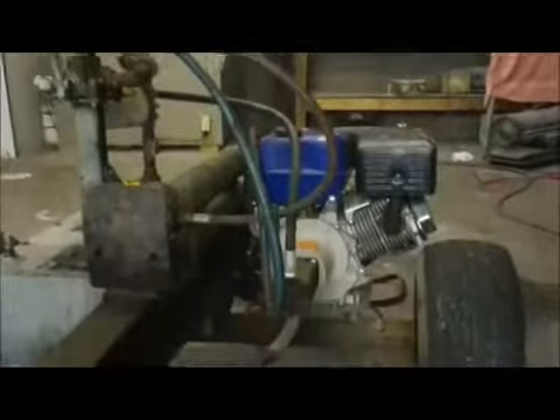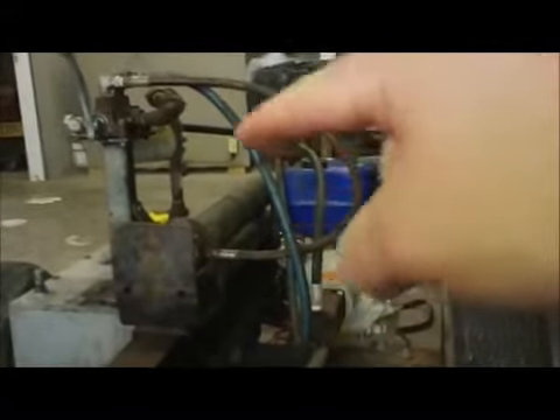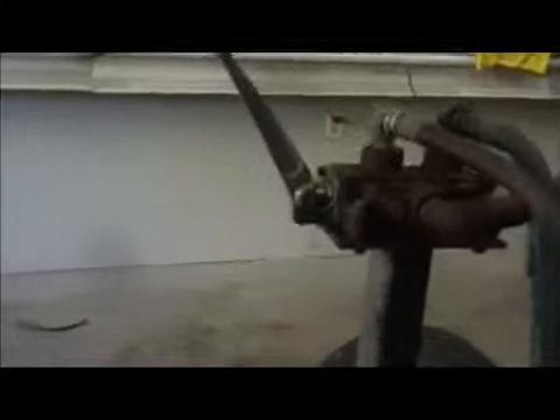This hose right here is just seeping little bits of oil — you can see the droplets right there. So I'm going to go to Napa and have them make me a new hose, and while I'm at it I'm going to have them shorten the hoses, because those hoses don't need to be that long. This one goes all the way out and around, and this one goes all the way up and back to the cylinder — it's just silly, it should just go right back. This valve does not have automatic reverse, which I kind of don't like, but the valve works, so I'm not going to spend $100 just to have automatic reverse. Maybe someday I'll find one cheap.